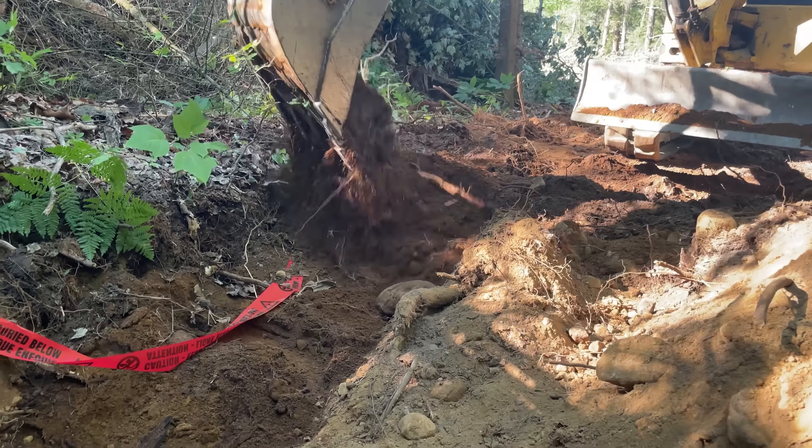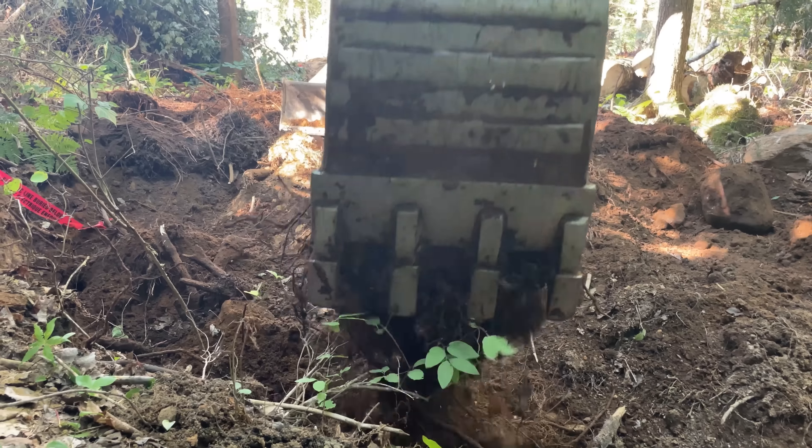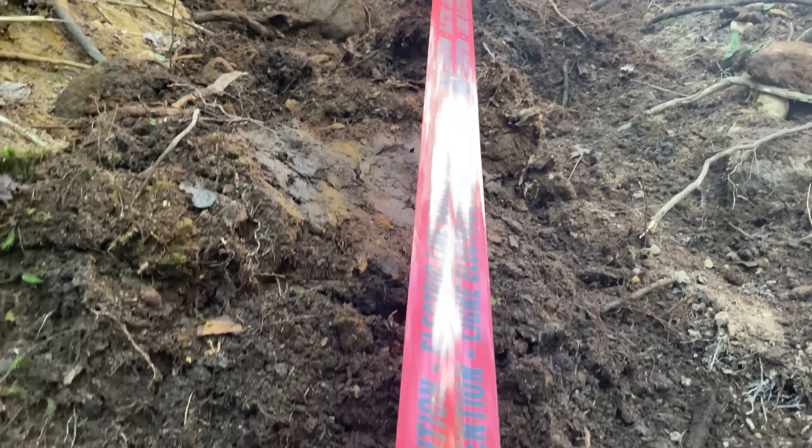It's Saturday morning. Craig's been here for a bit filling in this trench. We have to put a layer of soil down and then a layer of the red tape, and then top fill it with more soil, all while making sure the electrical line is 30 inches below grade.